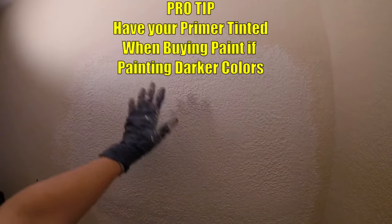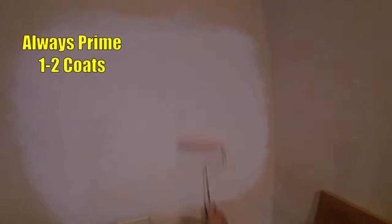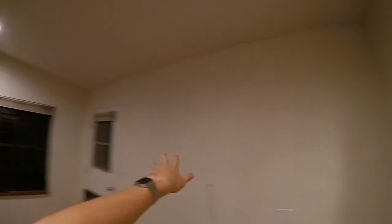I finished knocking it all down now. We're going to want to let this set up for a full 24 hours to dry. Then you're always going to want to prime raw drywall or raw drywall compound — always prime that first before you topcoat, especially if you're doing a patch and trying to blend it in. I finally got around to painting the room — the patch really blends in nicely; you're never really going to see it unless you're looking for these kind of patches.